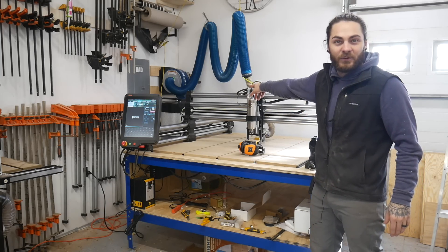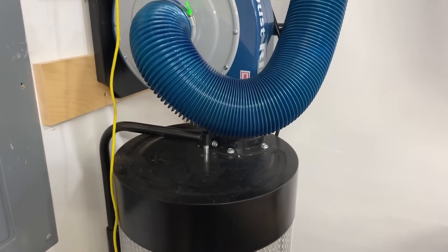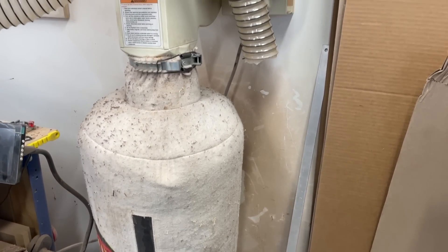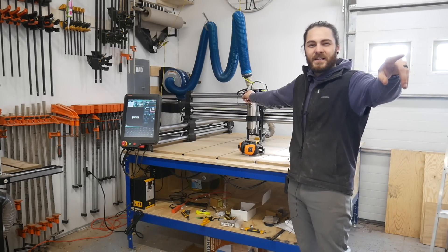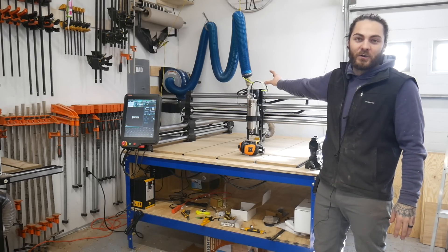This unit also has a filter — you don't have to get the filter, but the filter is a huge must. I'll show you the wall next to my other unit over there — you can see all the fine particles that leak out. That's the stuff you don't want to breathe in, that's the stuff you want to collect and it just doesn't collect without a filter. I have a Shop Fox version over there and it's only like 540 CFMs, so I'm super excited to have this bigger better dust collection in this corner.